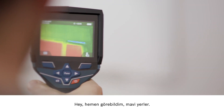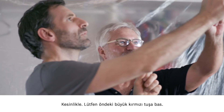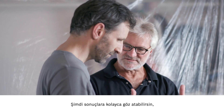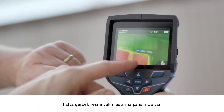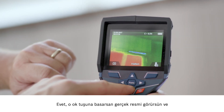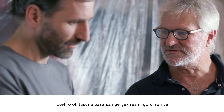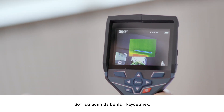You can see the blue points really clearly. It's really obvious that cold is getting in there. Press the large red button at the front and then you'll have a record of your measurement results. Now it's really easy to view the results, and you can even zoom in on a real image by pressing this button here. Press the arrow button and you'll see the real image — that way it'll be easier for you to show your customer where exactly you measured. The next step is to save what we've done.